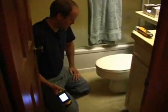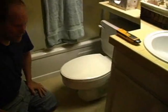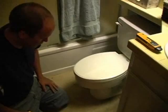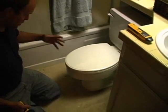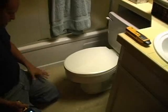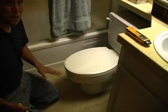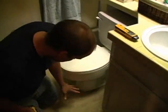Well, one of the interesting things that a home inspector does with his time is inspect a bathroom and the area around the bathroom toilet. Whenever I see a carpet that's secured to the floor, I put in my report a narrative that describes the contamination issue, because this carpet can't simply be picked up and put in the clothes washer if the toilet overflows. So whenever I see a carpet around here, I try to evaluate if this toilet is leaking by flushing it a couple times. I won't do it right now, but looking for stains.